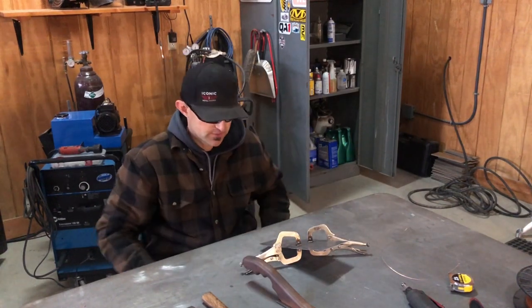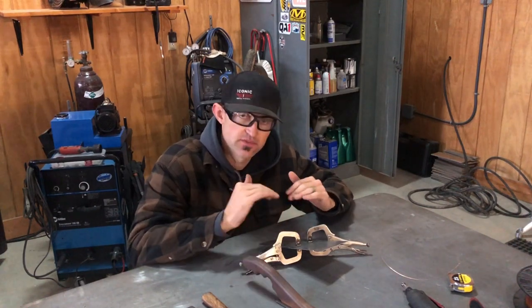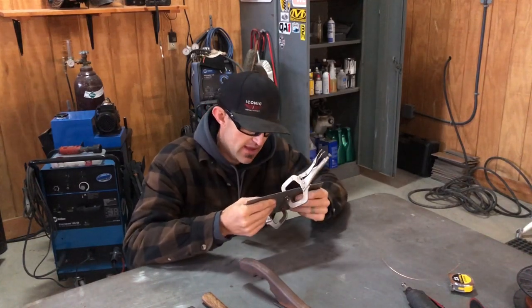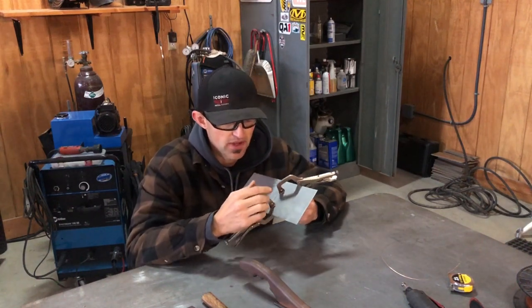It's so much distortion. So you wanna scribe it, cut it, file it, and you want the perfect match with no air gap. If you have an air gap, it's not a huge deal. You can planish it out. It's just gonna be more planishing in that area.